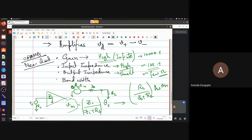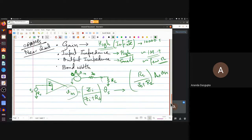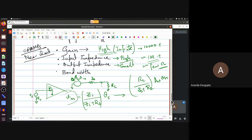The second video that has been uploaded has that. So there you would see that the reason why we are so excited about this huge gain that the op-amp has is that the op-amp, coupled with negative feedback, can end up giving you very, very stable gain. So in that sense, it's a wonderful thing to have. Not in itself, not the fact that the gain is 10,000 or more, which is important.